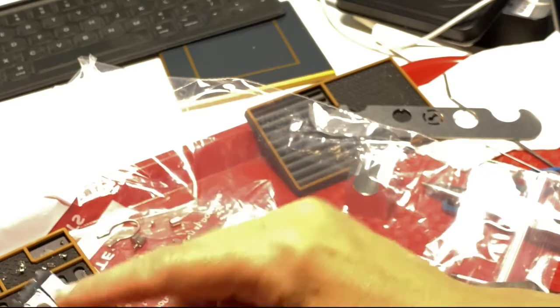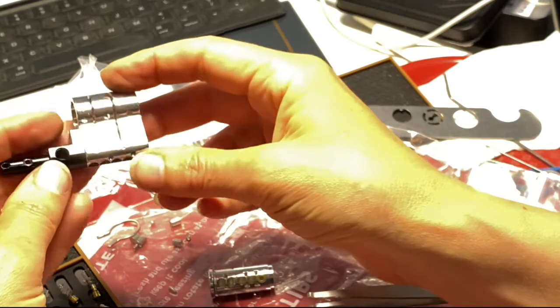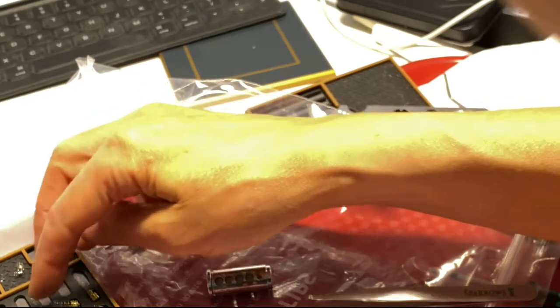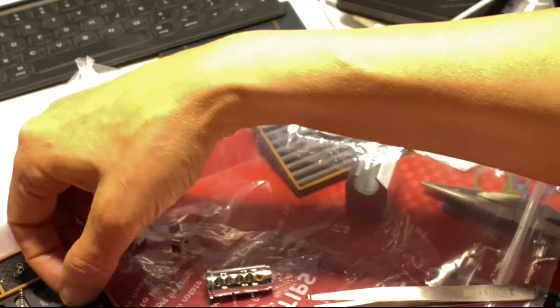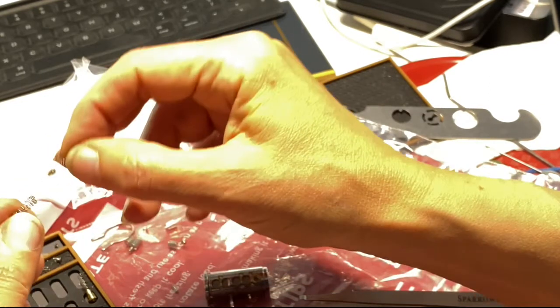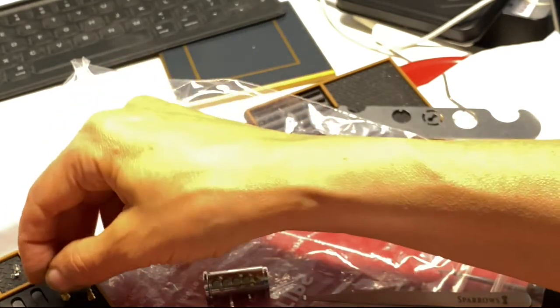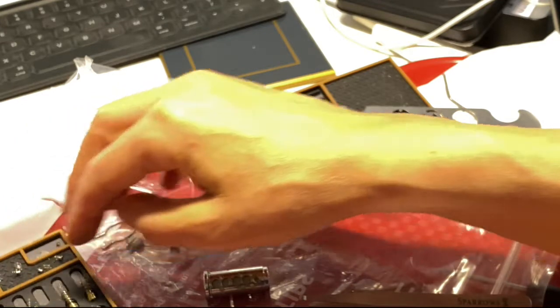Okay, there's these bottom pins for holding this bar in, for holding the two sides of the lock together. We don't need to take that apart. Okay, let's go after the rest of this mechanism. So what you can see is that the driver pin has a spring, an outer and an inner, and then an internal spring. It's very different from the multi-lock. And that together is a driver pin. And we have a whack of those.